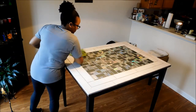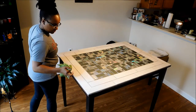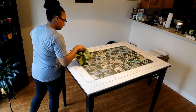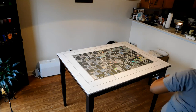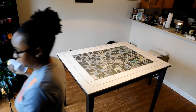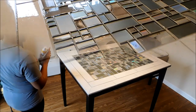I cleaned my table off with some cleaner to get all of the grout off before spraying the grout sealer. Make sure you have it all clean and dry. Here is the spray-on grout sealer — my dad recommended I spray it on the table two or three times to ensure that things on the table don't soak into the grout and instead just sit on top so you can wipe them away. I sprayed it on, let it sit for about two hours, sprayed another coat later that night, then wiped it off the next morning. We already had a spill and it wiped off just fine.